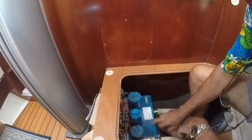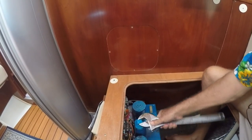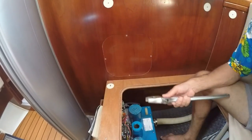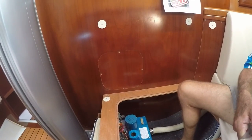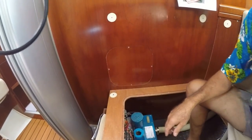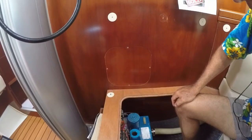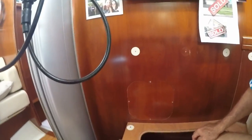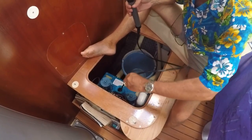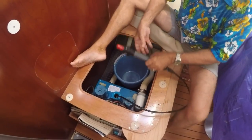Now what I'm going to do is to try and drain the inside of the unit itself. So to do that, I'm going to remove this part here, and that can go for cleaning. And now I have access to the inside of the unit, and I'll grab myself a bucket and a pump, and we'll start cleaning that. I've got a pump that I use for oil changes and so on, inserting the hose down to the bottom of the tank,